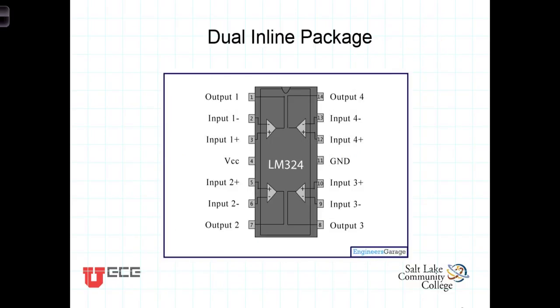The amplifiers we're going to be using are a little silicon amplifier that comes in what's known as a dual inline package, or a DIP package. Dual inline means that it's got 2 rows of connecting pins. In general, a semiconductor package like this always has a top. The top is marked either with a dot or a notch in it, and sometimes you'll have both. However they denote it, there will be a top to the package.